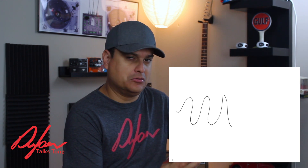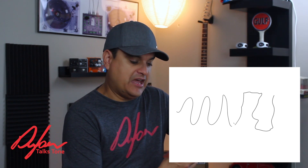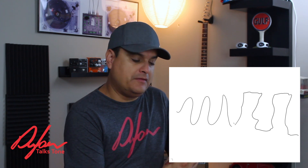Here's why — it's not just the architecture of the amplifiers that matters. It's how the signal flows through there and what actually happens to the signal when it gets smashed up. If we take a normal signal, our guitar signal doesn't look like a normal sine wave. Once we overdrive it, it starts to get jagged and messed up. On the ends of those sine waves where it gets messed up, the reason is that it's compressing and clipping — parts of it are actually getting cut off.